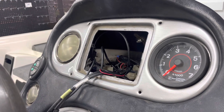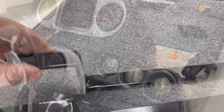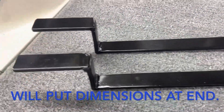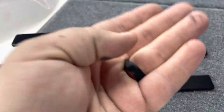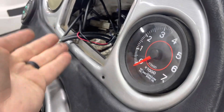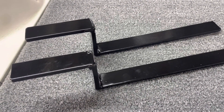These boats are known to be problem children when it comes to mounting bigger units, just because of the way they're laid out. We're going to get creative. My dad welds and fabricates, so I had him make me a couple of simple aluminum brackets that are going to slide back in there. I'll bolt these down through the fiberglass with extra support underneath via another aluminum plate, and also anchor them in from this front side with another aluminum plate. It's a 12-inch unit so we want as many bolts as we can get.